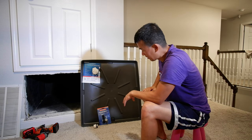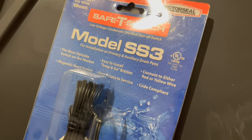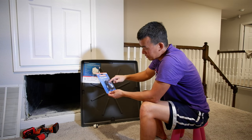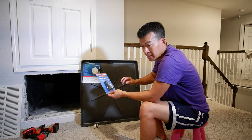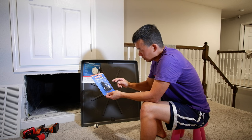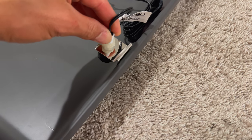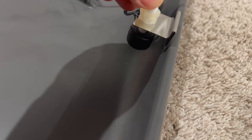If you guys need something like this, check out the links down in the description. In addition I picked up an additional safety switch. This one's actually a floater designed for a condensate pan and it's the same switch and same brand as the one I already have in there. Since I already have a float switch doing the job, all I have to do is connect this one in line in series with that one so it has two switches — both of these have to be down for the unit to run. To fit it onto the plastic pan, I have to drill two holes so I can mount it on the top edge.